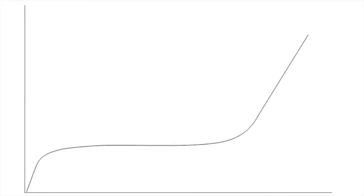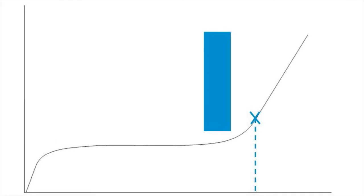When running post-view torque in a fastening operation, once the rundown complete point is reached, the Power Focus 4000 will look back at two intervals. The first interval is a max torque interval — a torque level is specified for this interval. If that torque level is exceeded, the fastening will fail on the post-view torque.